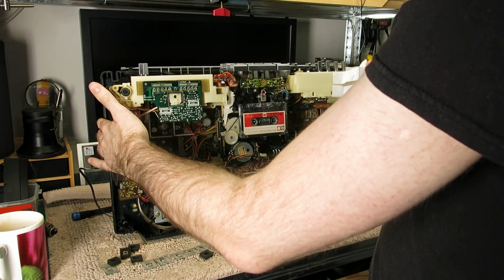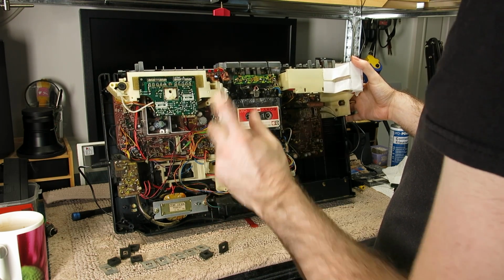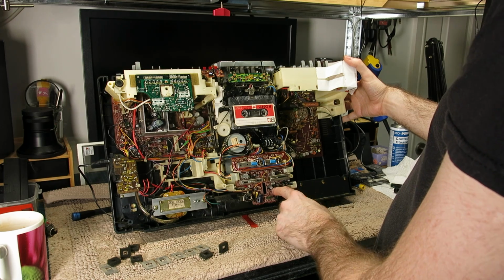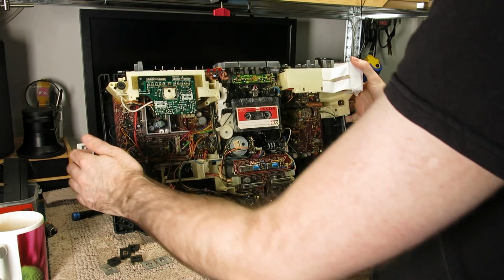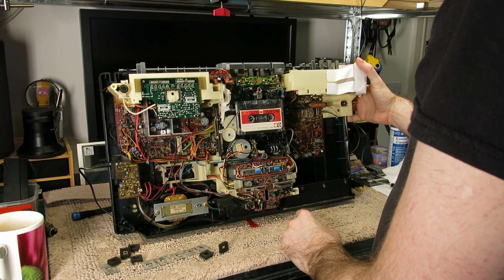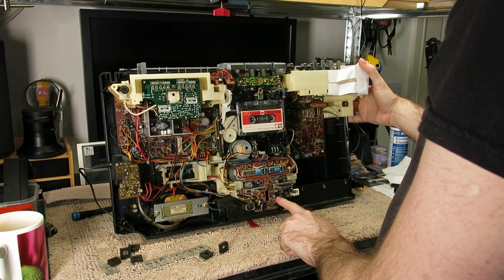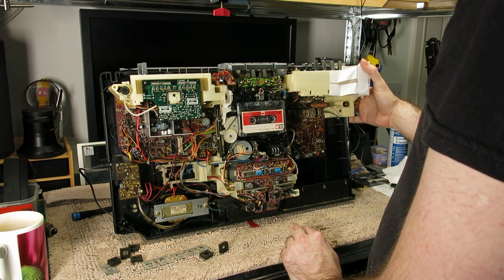I was looking over this all this time and thinking, well, I haven't spotted that chip yet. It's usually about a 14 or 16 pin chip. There's a little chip down at the bottom here just hiding under this capacitor that's got a heatsink on it, and I thought, well, that's too small to be a BBD chip, I think, but it is next to the echo control. I was going through the circuit diagram and something caught my attention. I wondered why this was a 2-watt audio driver. Surely that should be a BBD chip, right? No, it doesn't use a BBD chip.